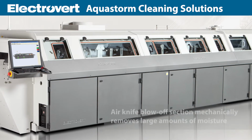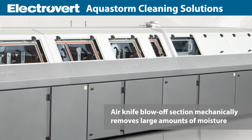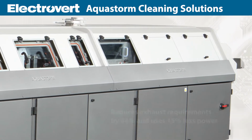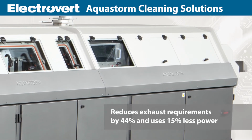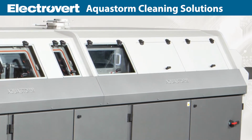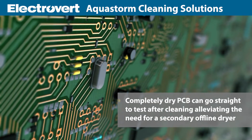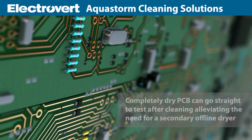The patented torrid zone consists of two sections: an air knife blow-off section to mechanically remove large amounts of moisture from the product, and a forced convection bake-out section to evaporate the remaining moisture from the product. The module reduces exhaust requirements by 44% and uses 15% less power when compared with conventional drying systems, providing a rapid return on investment. Another benefit of torrid zone drying is that completely dry PCBs can go straight to test after cleaning, alleviating the need for a secondary offline drying system.